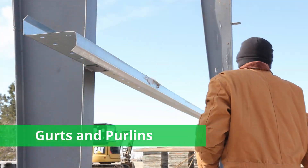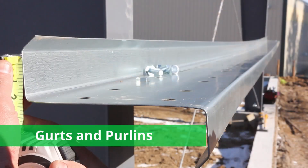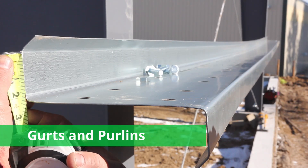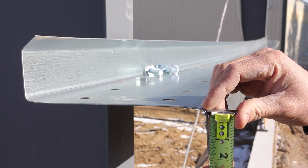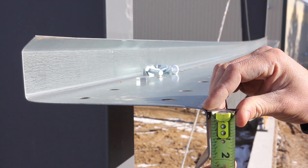While we're talking about the primary and secondary framing going up, it's a good time to explain the girt and purlin lapping. Girts and purlins are basically the same thing — usually Z-shaped members — but one flange is a little bit thinner and the other flange is a little bit taller. On a 2½-inch girt, you'll have one flange at 2⅛ inches and the other at 2⅜ inches. If you have them backwards, they'll bend open and won't fit correctly. So make sure the girt is in the correct orientation. Sometimes, depending on the machine that's roll-forming them, there will be an arrow — that arrow points to the bigger flange, so when you're up in the air moving stuff around, you can see it pretty easily.